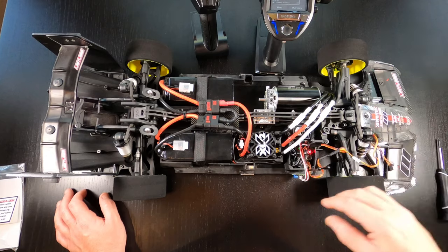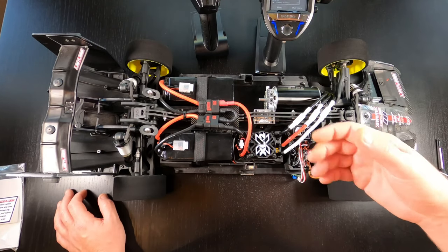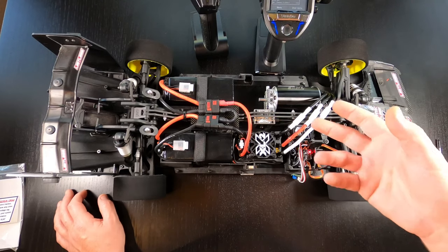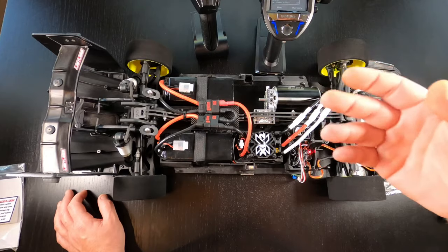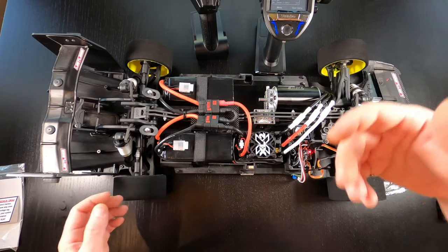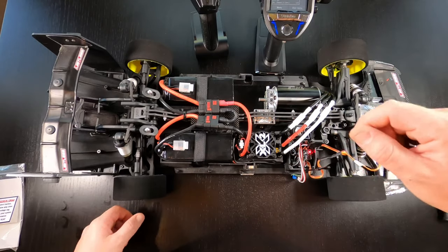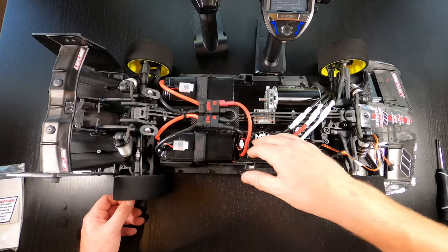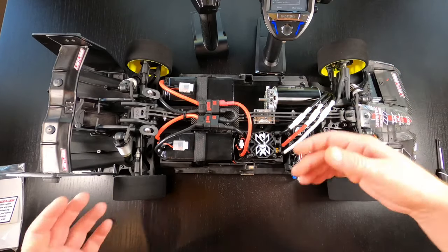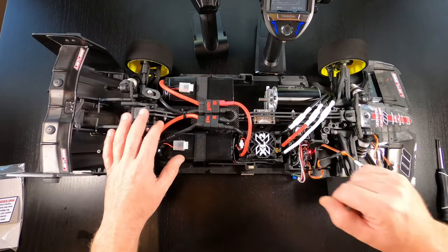So now we connect the Perfect Pass and this is how we're working with it. You guys probably want to verify that Castle Creations received 100% throttle from the recalibration process, or whichever ESC you're using. This works with all other ESCs — some just don't have data logs so you can't see it — but for the sake of this test we're using Castle Creations.